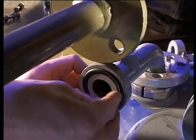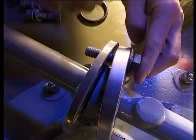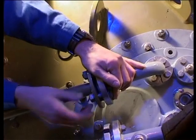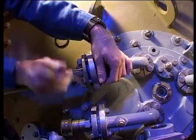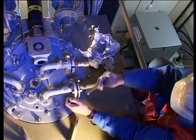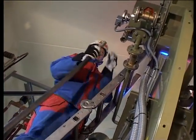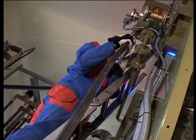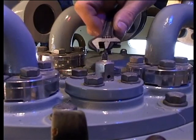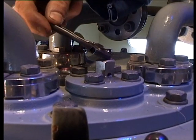Renew O-rings and restore the connections on the cover to the flanges of the conservator pipes and the pressure relay. Leave the valve on the pipe to the conservator open. The venting screw in the cover must be closed. Fill the tap changer to a suitable level through the conservator. Use the venting screw in the cover to let air escape. With this method, a suitable air cushion is formed automatically under the cover.